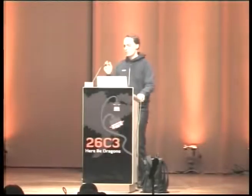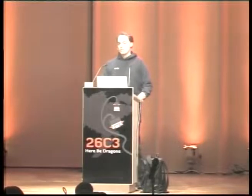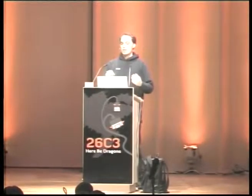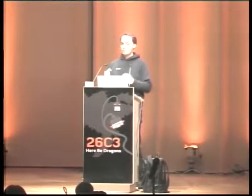And this is already an interesting thing because, for example, if a hardware designer was clever and thought, oh well, I don't want the hacker to be able to access this USB port which this chip offers, we don't want the hacker to have access to that. Well, USB is a bad example, I'm sorry. Like an I2C bus, which might be unused. You can use boundary scan to override the actual logic functionality inside the chip without touching the physical package or the physical ball at all, because it might be BGA and buried under some other traces. You can use boundary scan to modify what the chip sees without even touching the physical pin. So this is something you need to be aware of if you hide pins by just not routing them. They might be accessible over boundary scan.